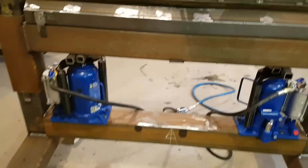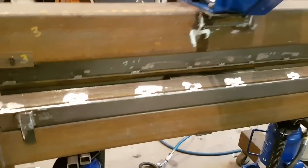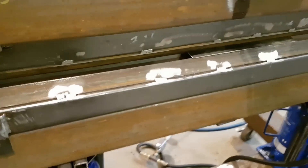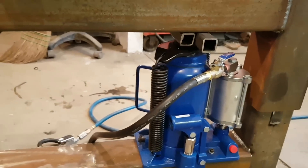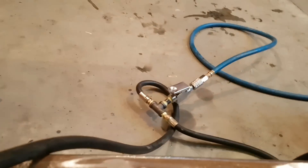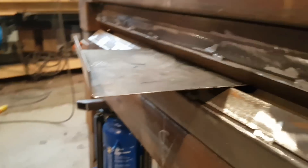Today we're looking at my homemade brake press — it's 36 inches wide. I made my own top and bottom dies just out of angle iron. You can see I have a piece in there ready to go. I have two hydraulic-pneumatic jacks plumbed together to one switch, so it comes up fairly even. I've got pins so I can adjust the height of the top die. We're going to do a bend and see how it looks — the last one I did turned out really beautiful.